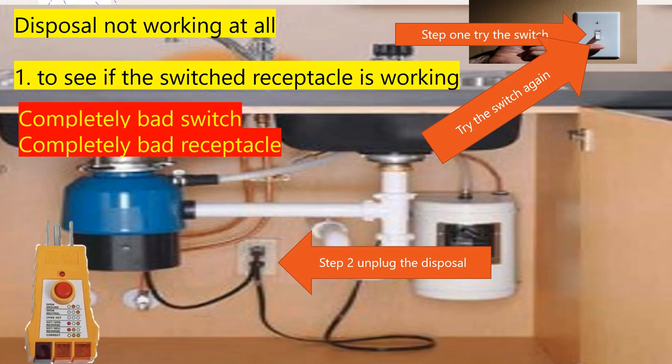That's where we're going to stop today before we start getting into some of the other problems tomorrow. If I was reading an error code or felt like I had a bad neutral, I would start by first replacing the receptacle up to code. Then I would replace the switch up to code, testing them one at a time. First replace the receptacle — if that fixed the problem, done. If not, replace the switch. This is after doing some troubleshooting. I may go to the panel first, but likely if I'm showing an error code, the first thing I'm going to do is replace the receptacle. You can have a bad connection inside that receptacle, something comes loose, or the receptacle just burns out. Then you just start replacing the components one at a time — start with the receptacle; if that doesn't fix it, go to the switch. I would also check with my volt meter, but this will get you in the right direction.